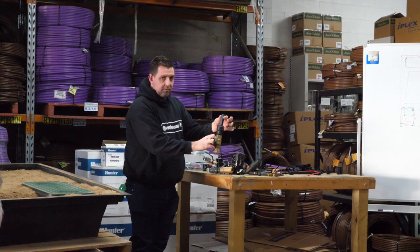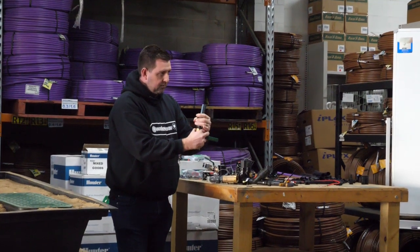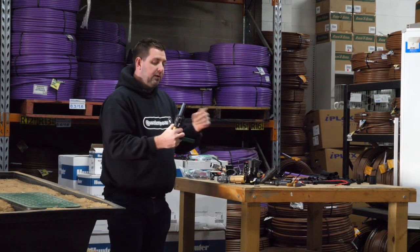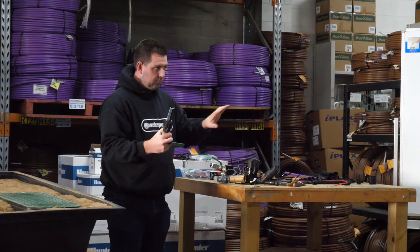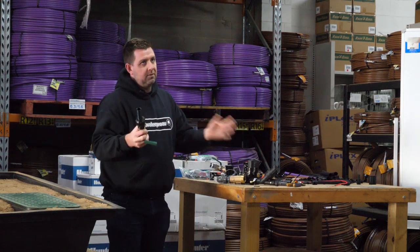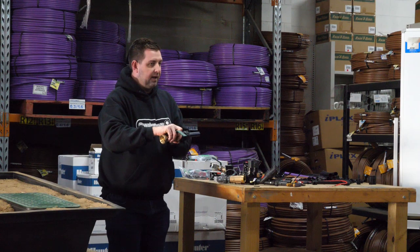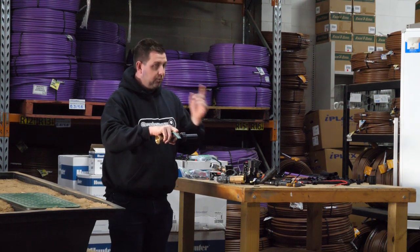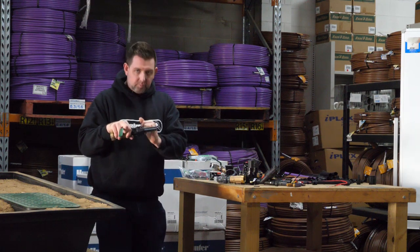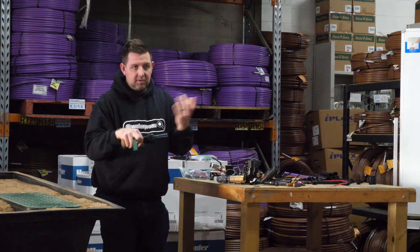If anyone's not familiar, that's Blue Line - it's a mains pressure pipe, it's flexible, and it works with compression fittings at this size. Once we start getting into 50 mil and above you can get electrofusion fittings, which is a whole other training session you'll probably never come across - the fitting becomes a welded fitting that welds using electricity, melting the fittings plastic to the pipe's plastic using coils that heat up.